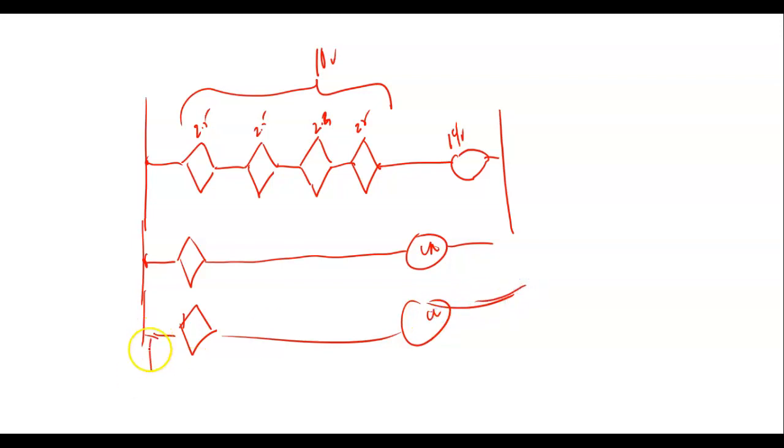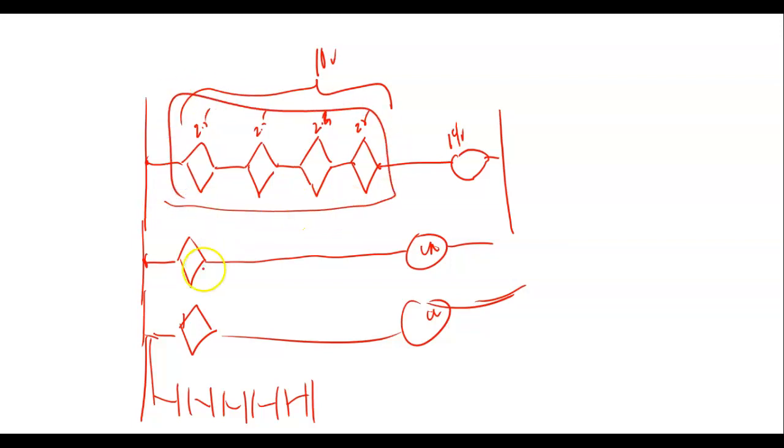Control relay. And then down here in my actual logic, I could put as many contacts off my control relays as I needed, right? So if you had to do this, then the only option you got is to let each sensor pull in a control relay and then use the contacts of the control relay to do your logic. So y'all see what I'm talking about? So this could cause a problem with solid state. Normally solid states control relays anyway, or they go into a PLC.